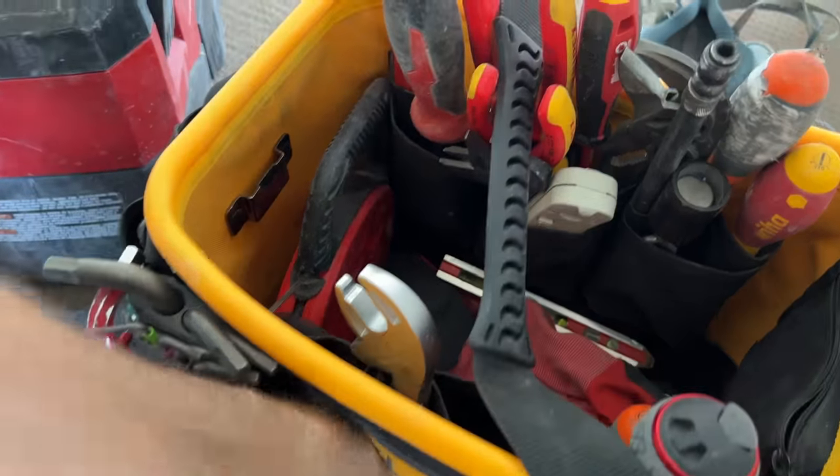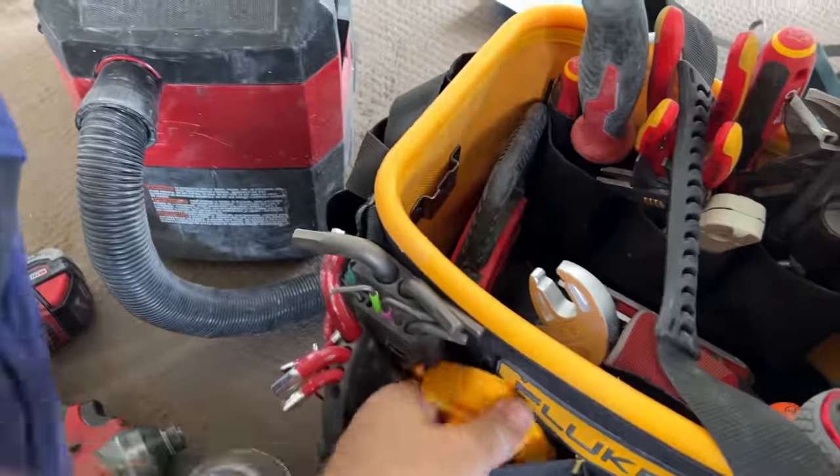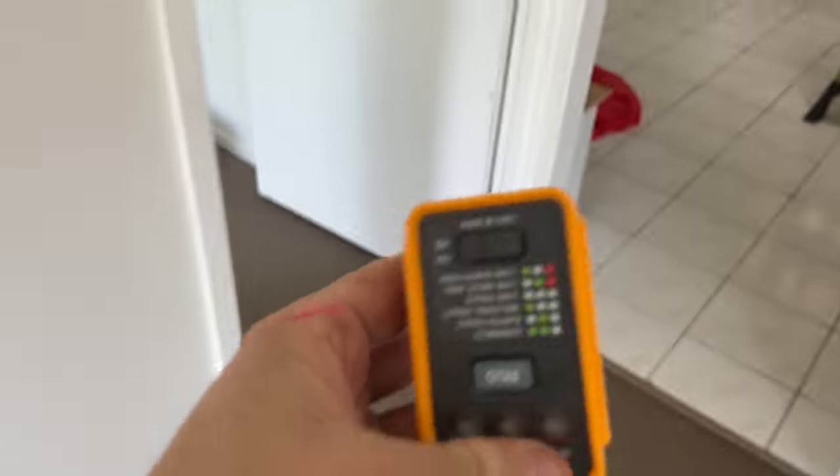What's your guess of the cabling they've used in this house? I'm presuming it's going to be solid core — it is an '89 build, so usually around that era and before is solid core. We'll go have a look, we'll pull a power point off. We'll also turn the power back on and I'll show you an RCD tester I picked up the other day from Sydney Tools — it's from Fluke. It's really cool, I haven't used it too much, so let's give it a look.